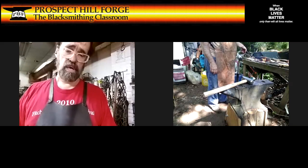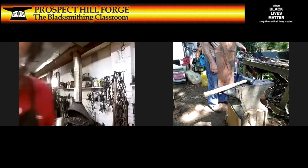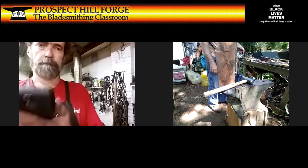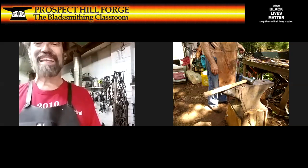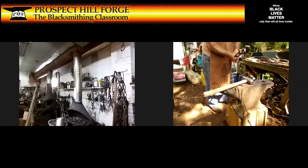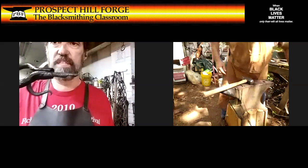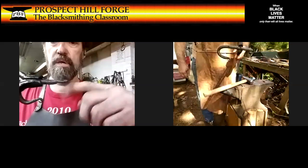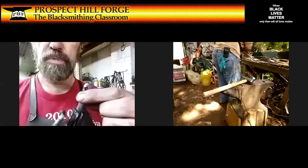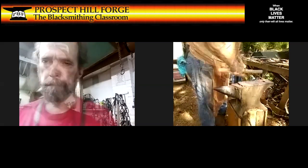And now, doing that shoulder, this is one of the tricky bits. Now, in putting the shoulder, am I doing it with the curve facing up or down? With the hook facing down. So, yeah, you'll be holding it in this position to set it on the anvil and make that shoulder that is just so wonderfully visible. There we go. Helps make it look intentional. All about intentional. Say about half thickness.